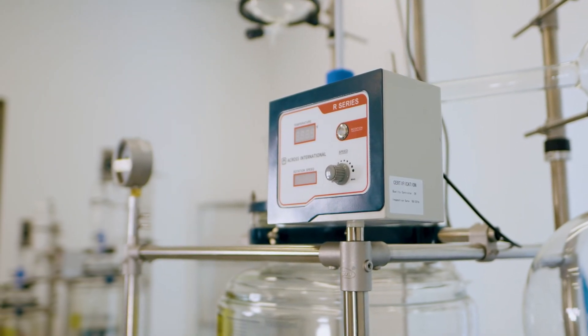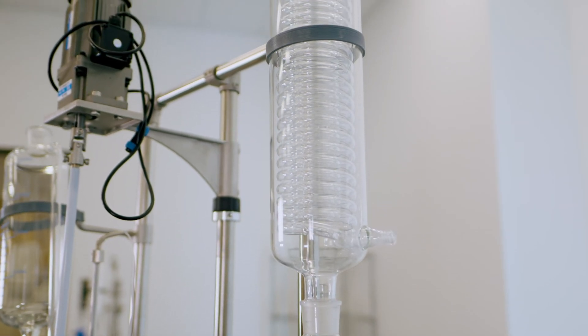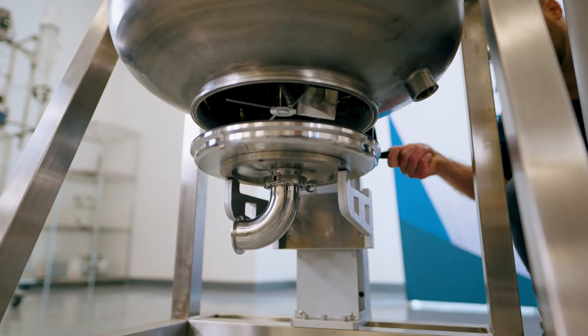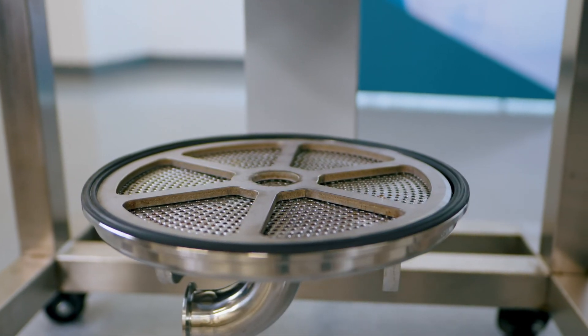This temperature flux, normally between negative 30°C and positive 40°C, is essential for efficient and controlled crystal growth. Once the crystals have been grown, the mother liquor can simply be filtered out through the filter plate at the bottom of the reactor, leaving dry crystals remaining in the reactor.